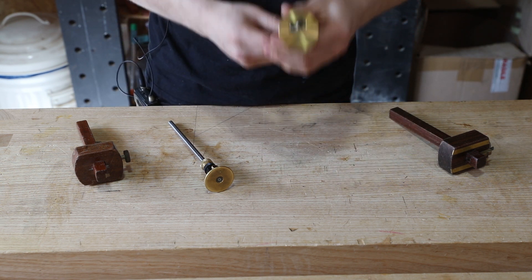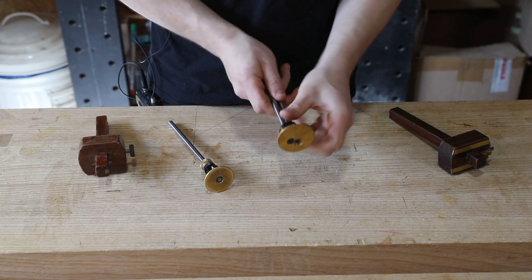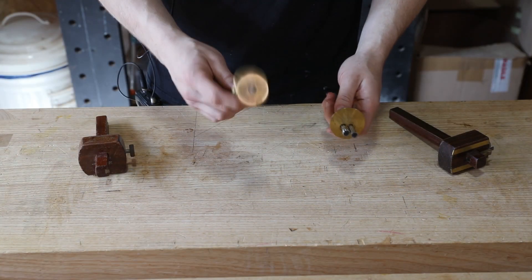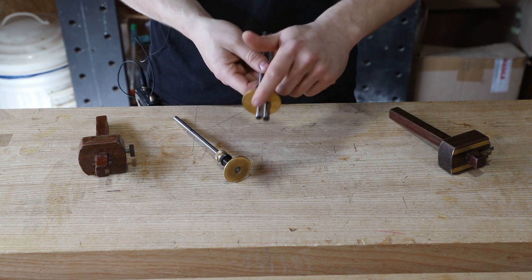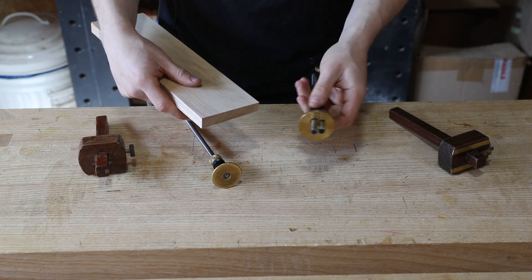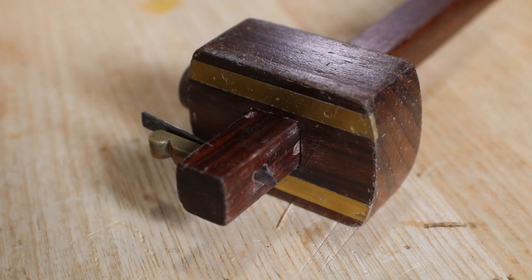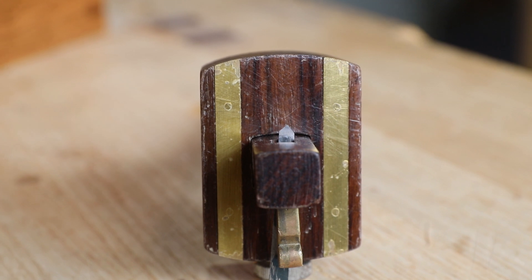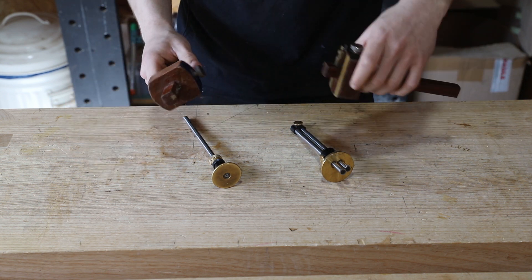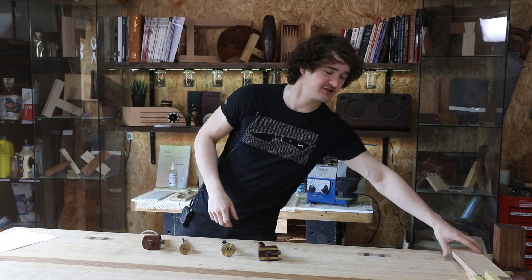This one here is a mortise gauge. On this traditional marking gauge we have two pins on the back, but this one has two rods that can be individually offset from one another and the stock itself. It's pretty much the same design but with two rods, and you can also use it as a single marking gauge by simply using one of the rods instead of both - so if anything it's a little bit more versatile but a bit more cumbersome. And finally this one looks very similar but has a knife in it as opposed to a pin - this is called a cutting gauge and is primarily used for cutting across the grain, which I'll show you later on.